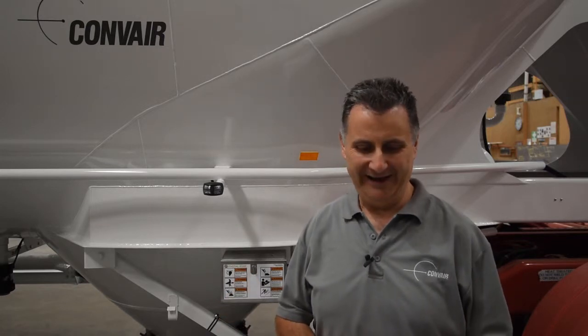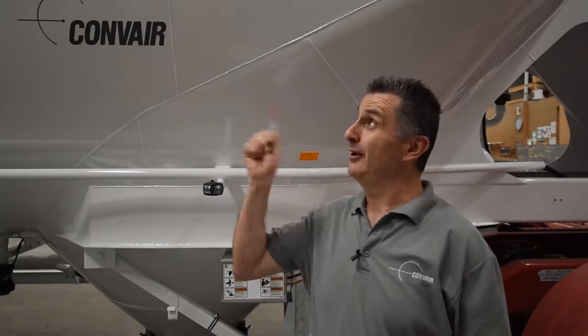Just a couple of last checks before we take off for the day: ensure that your handrail is down, all the hoses are secured and hammers put away, your toolbox is closed and nothing's been left on the tanker, and also make sure that your landing legs are raised. Hope this presentation has been useful to you. If you would like some further information or a copy of our inspection sheet, please contact us at Convair. Thanks for watching and safe travels.